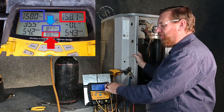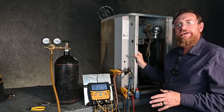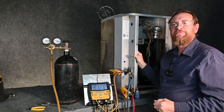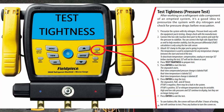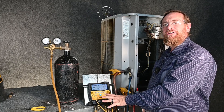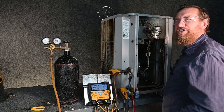Now I can see how much my pressure is going to change with my temperature. On a lot of these digital manifold gauge sets, they have a pressure test function. A newer version of the Field Piece, the SMAN 480, which I don't have, does a pressure test function for you automatically — you hold for the pressure test and it monitors the temperature change and the pressure change over a set period of time. Since my manifold gauge set isn't going to do it automatically, we can do the long math, or we can use a tool.